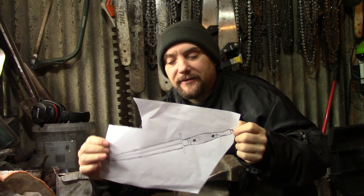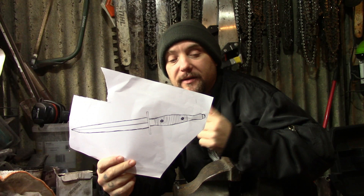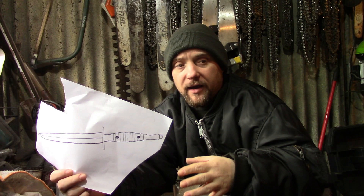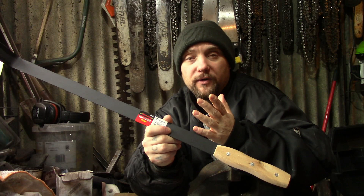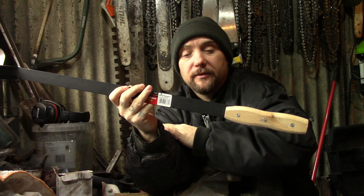I don't think I'm going to have a full taper on the edges — it will be more of a sort of maybe 10mm grind on each side, which you'll see when it comes to it. Guard will be the same basic shape. I'm not sure what handle material I'm using yet. What I'm using is a weed slasher to make this project. If you do this, you don't need any forging capabilities because this is already hardened and tempered tool steel. It will bend and go back to its nice straight shape, and it works really well for home projects — they're only about eight quid.